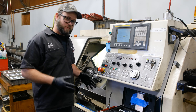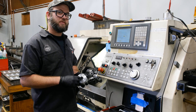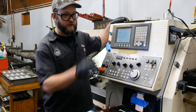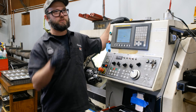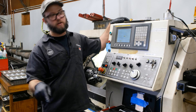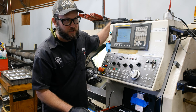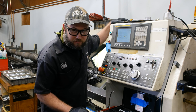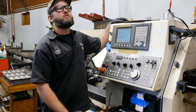We hold tenths on this machine. We're making hub shells, and the bearing bores on these hub shells are plus or minus two tenths. And that's tenths of a thousandth of an inch. In machinist's lingo, we're talking thousandths — so 0.001, that's a thousandth of an inch. Tenths, or ten-thousandths of an inch, is the next place: three zeros and then a one, so 0.0001 — or in this case 0.0002 plus or minus two. That's ten times thinner than an average human hair, which is usually between three to five thousandths. So plus or minus two tenths of a thousandth of an inch is really small.